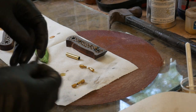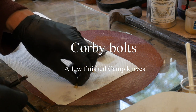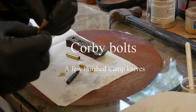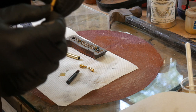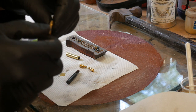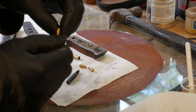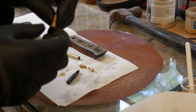It's not often I get to fit Corby bolts. I'm fitting them to this knife. The Corby bolt, when finished, looks just like a quarter inch pin, but when you look at it closer you can see it's got shoulders. It gives you a mechanical bond as well as the glue bond, so added security.